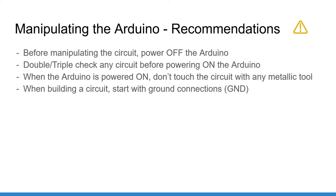And finally, fourth: when you build a circuit you will connect multiple hardware components together and/or with the Arduino pins — make sure that all your components are connected to the same common ground. This is super important both for safety and to get correct results. A good practice is to first connect the ground whenever you add a new component. Now don't be too scared — if you follow those basic recommendations you should be totally safe. Let's build that first circuit.